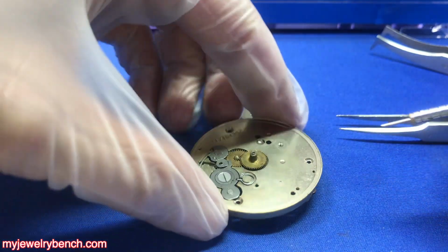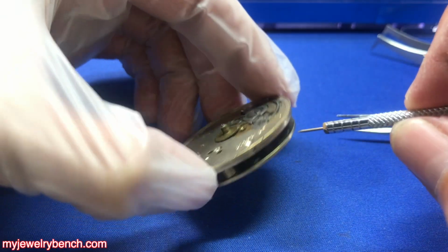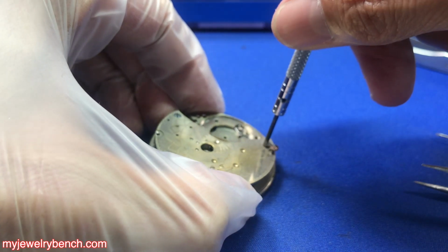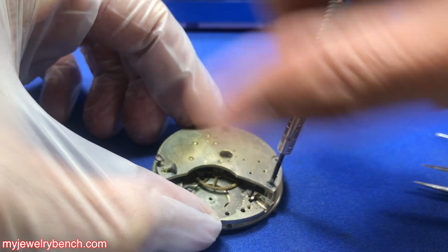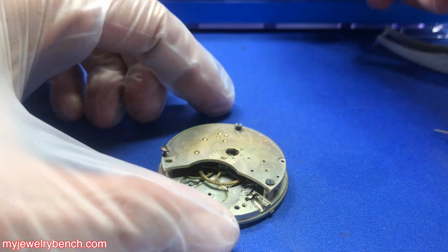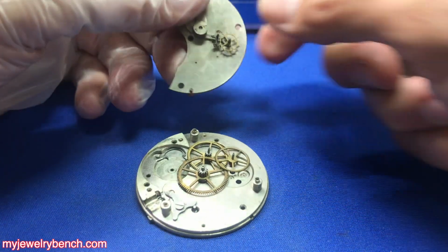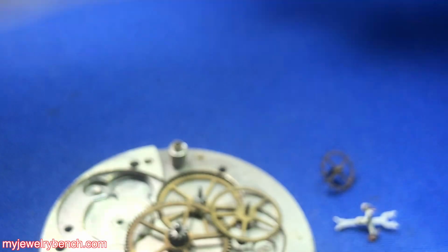Okay, so now that I bored you with a shameless plug, let's get back into this watch. The Elgin Watch Company, which actually wasn't really the Elgin Watch Company, it was actually part of Elgin, were watches that were distributed under the Atlas line that were lower price pointed watches geared towards everybody or the common man. These were typically 18 size watches. There were a few odds and ends that showed up in like 16 size and 12 size, but you're not going to see many of those. Most of them were 18 size, and most of the ones I've seen are 7 jewel. I've never seen or had to work on a 15 jewel Atlas watch, although I've seen some Atlas dials on some Elgin watches. So you might find that occasionally because the parts are completely interchangeable.